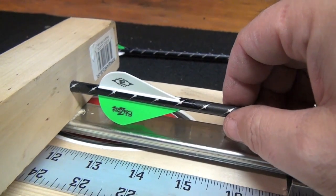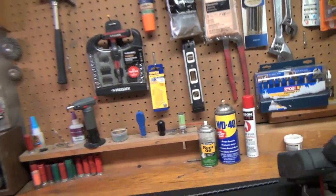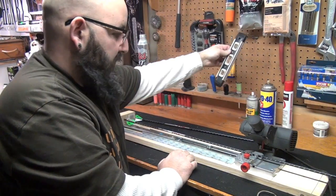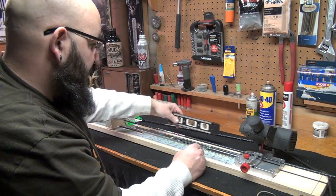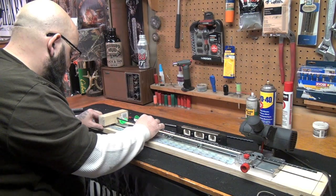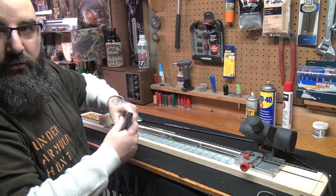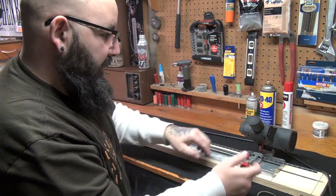It just barely goes in the hole, just enough to hold it — it's in there solid, the exact same size, it's not going anywhere. Now I'm going to grab the torpedo level just to double-check that it's level — which it's spot on. Now with that being spot on, let's get it dialed in at 25 and three-quarter. There's 26, and 25 and three-quarter is right there. Now I'm going to screw it and lock it down, put the level back on it — it's dead-nuts level. Now let's fire up the saw.